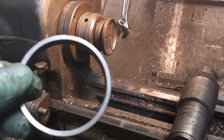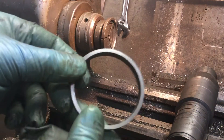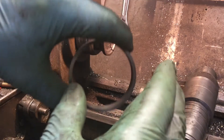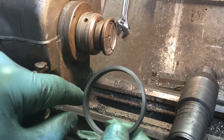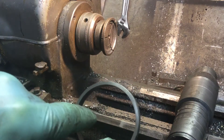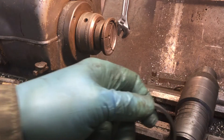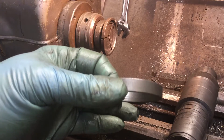My next step is to take a ring and file a very thin notch in it. Then I'll use an expander to go inside the ring and expand it. Since that notch is the weak spot, the ring should fracture right at the file mark. You don't want to go too deep — about ten strokes with a three-corner file puts enough of a nick. For thinner rings you can clamp in a vise and hit it with a hammer to fracture it, but these rings are much too wide for that.